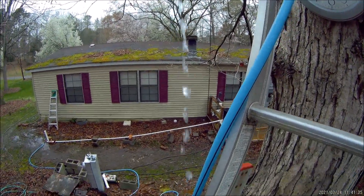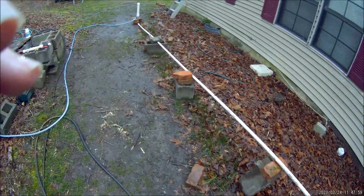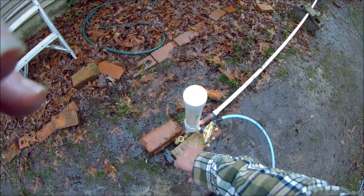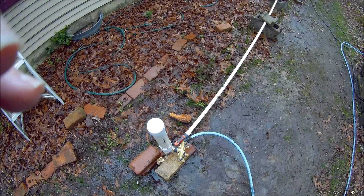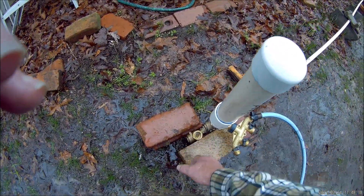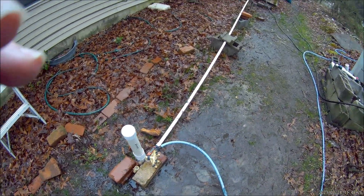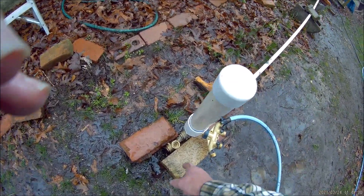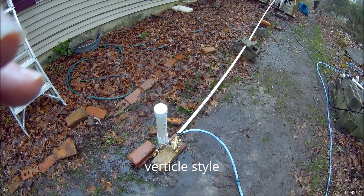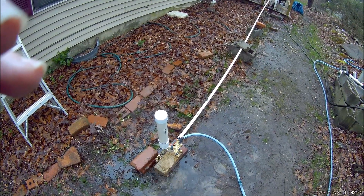Now we hook up and test the vertical pump. The barrel is almost full again with the same 20-foot drive pipe. The key difference is this pump has the waste valve at the very end of the system, and instead of a spring-type check valve there's an identical swing-door check valve turned upside down, with the outlet between the check valve and the pressure tank. This style starts right up on the first push — which has consistently been my experience with the vertical pump style.